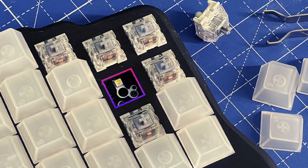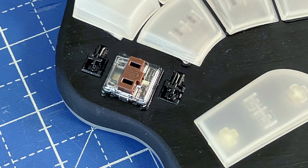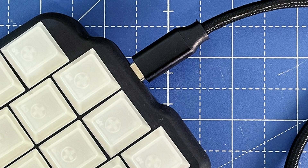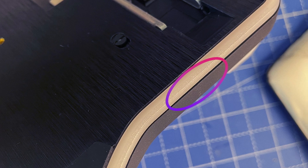For example, the holes for the switches are slightly tighter — you'd need to be as strong as me to pull them out. There are also some issues with the clipping of the stabilizer; the holes are a bit too big, so the stabilizer stem goes through the top plate and gets stuck. We also found that you could see the metal part of the USB cable when plugged in. On top of that, the shape of the top panel doesn't completely fit the diffuser of the underglow.